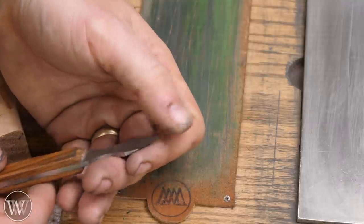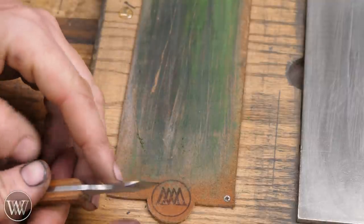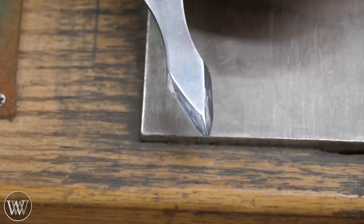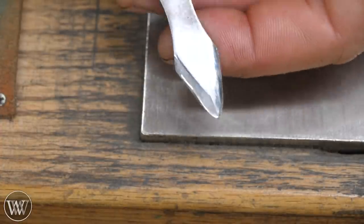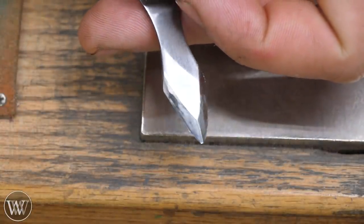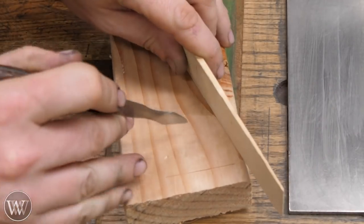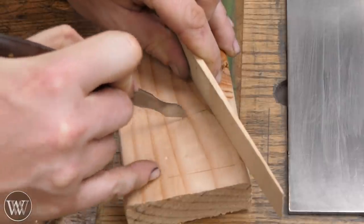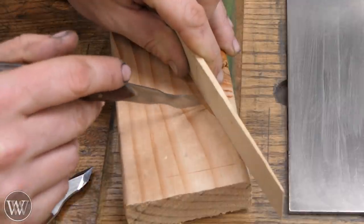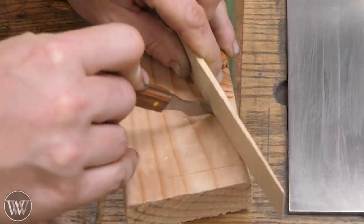In many cases that's really not that big of an issue because it's just so small I can take it over to the strop and it's right back to where it should be. But if that hook bends over too far, then you're going to want to get rid of it. That's why on most of my marking knives — my personal one — my tip is very, very rounded. You can see it doesn't have too much of an actual tip; there are several facets running all the way around it, and that's how I like it. Rather than having an incredibly fine tip, I have a lot of facets. Now, if I'm trying to get into the corner of a dovetail, I'm going to be a millimeter or so away from getting that line all the way in there, which 99.9% of the time is not a problem. But if it is, I have another knife set up with that perfect sharp tip just to nick in there and get all the way into the point.